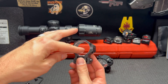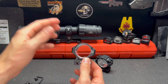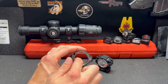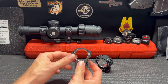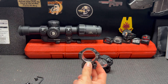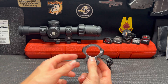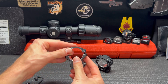To me, this is the biggest selling point: they machine this out specifically after it's assembled to give you a perfectly round hole. That does a couple of things — one, it prevents hot spots or uneven pressure on your scope body, so the entire scope ring is applying pressure equally on your scope, which means it's going to hold on to it better. You also don't have to worry about crushing your scope tube. On cheaper rings that aren't perfectly round, whenever you tighten down it's literally bending the top piece around the scope body, which cannot be good for it.